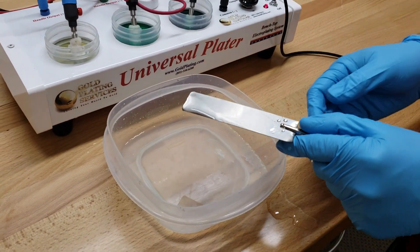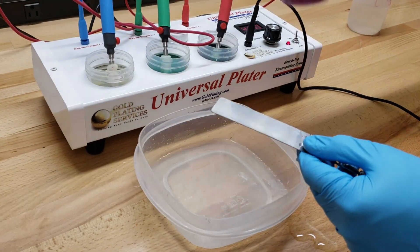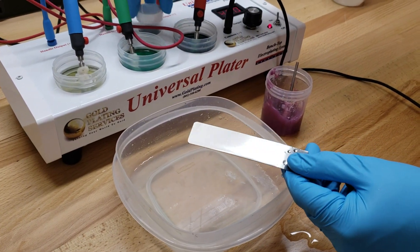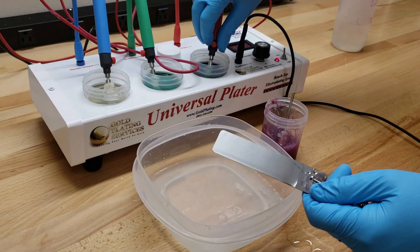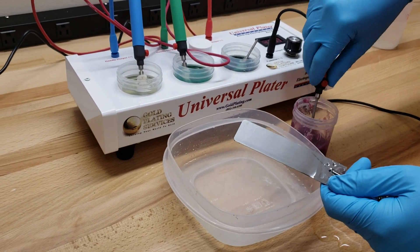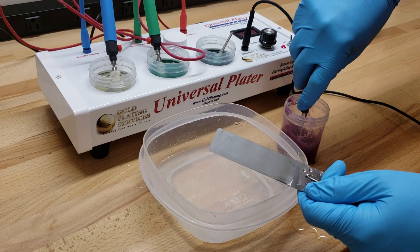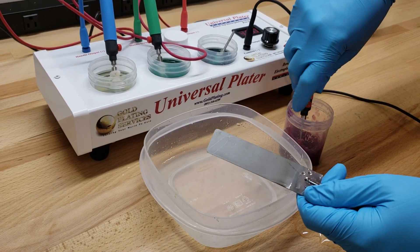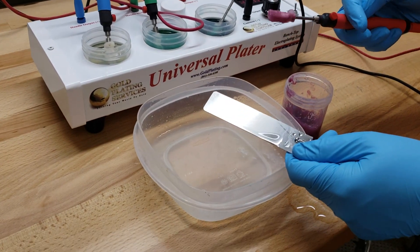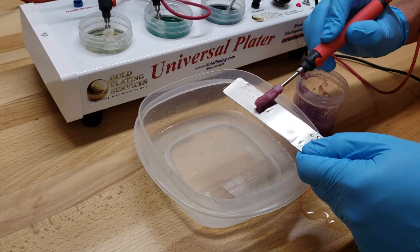Now I'm going to go ahead and gold plate it. I have a separate beaker that has gold in it — you actually could put it in the small one right here, but I have it in a separate side beaker. Just undo the thumb screw here and stick it onto this bit, which is a really nice thing about those combination handles. We're already at the right voltage — 4 volts will work well for gold plating. We'll turn it up a little bit if we need to.